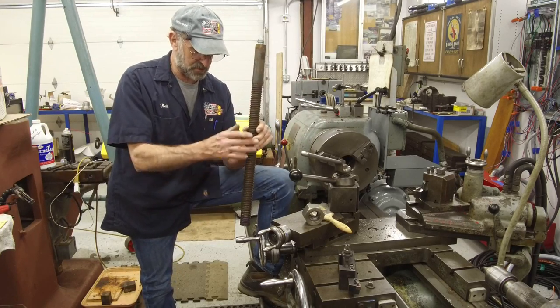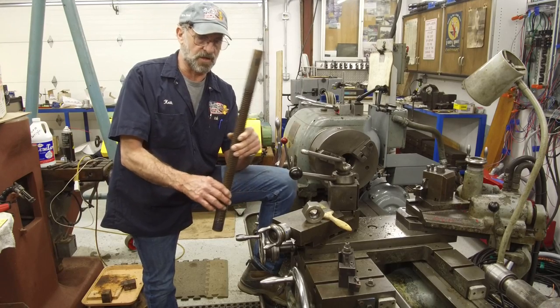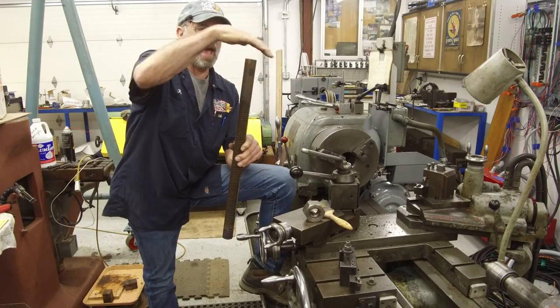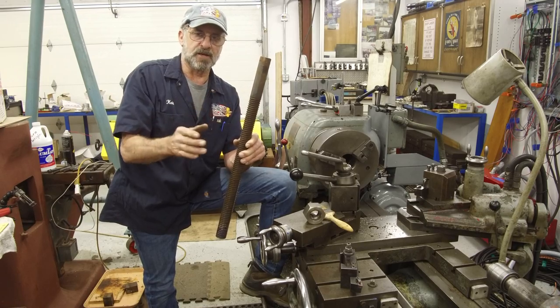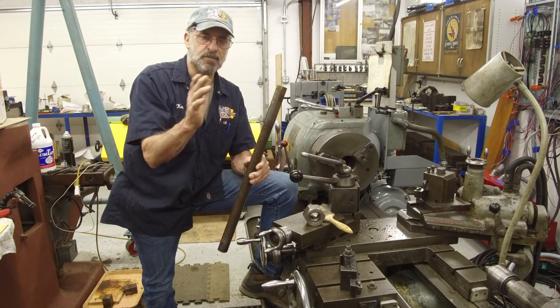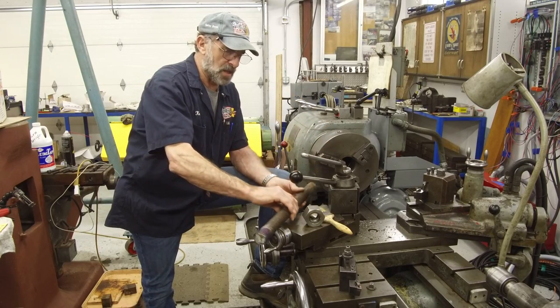Normally this here is in the vertical position like this, or leaning whatever way the jack is. Some of the jacks are tilted. A pad with a pivot mounts on here, and then you have an Acme nut with a T-handle on it, and you spin it around, and you can jack this up against the hull and stabilize the boat when it's out of water and up in blocks.